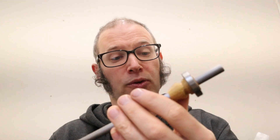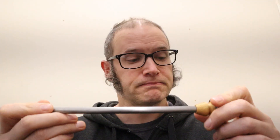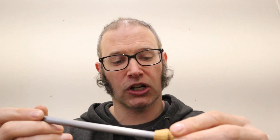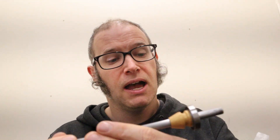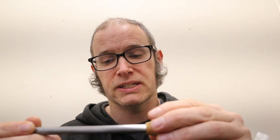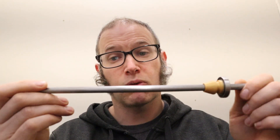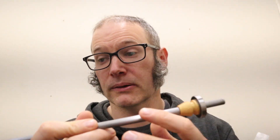Other parts are 3D printed, like this little gold plastic piece. The way I put this plastic piece and this bearing together — they're stuck together at this point because I hammered them on with a rubber mallet. I forced it onto this bar because I don't want this part twisting, and I also don't want the bearing falling off too easily. Both are attached pretty well to the rod, just by virtue of the tolerances I used on the 3D printed part.